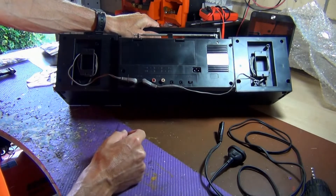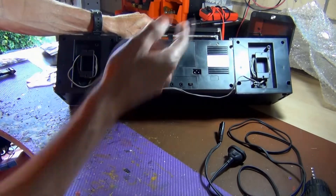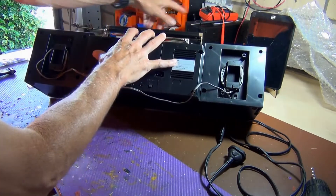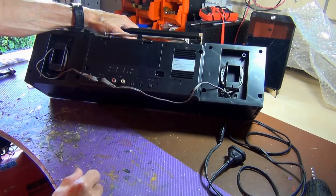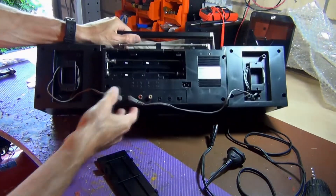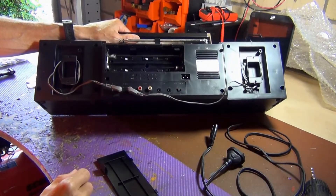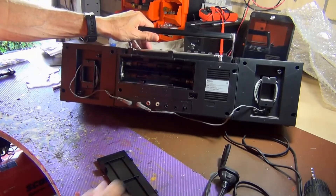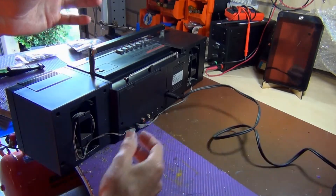It also has beat cancel, which is kind of cool — I'm interested to try that feature out. There are speaker left and right outputs so you could connect other speakers instead. I'm using a 9 volt DC bench top power supply rather than AC — you really don't want to be connected to AC when mucking around with the components. I also checked the battery compartment, which is the scariest part on these things. Luckily this one's in pretty good condition — thankfully nobody left batteries in there to corrode. Make sure you check the power lead too; make sure it's got no cuts or problems.